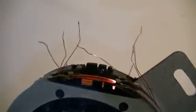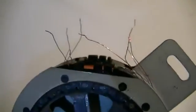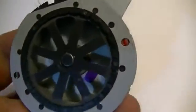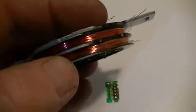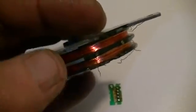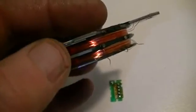We can simply do this with our ohms meter or just using a continuity test on the digital multimeters. So we will go ahead and find out what's what. With this motor we may try something a little different — we will see if we can get it to run with one run coil and one trigger coil, which will leave us two coils, one on each side. And we may even set up a separate circuit for those two coils.